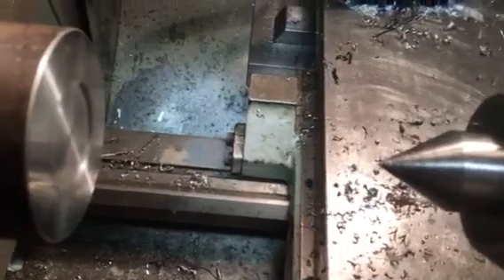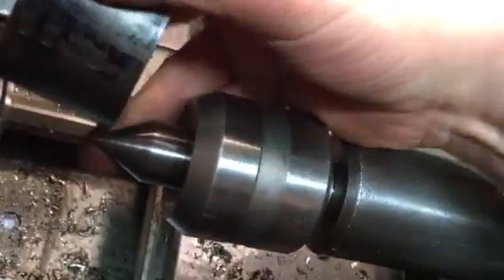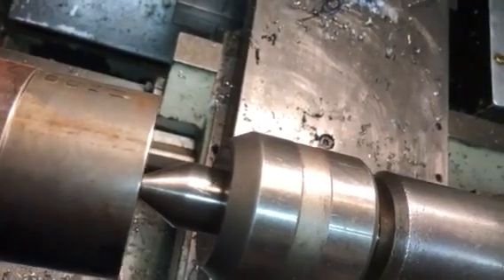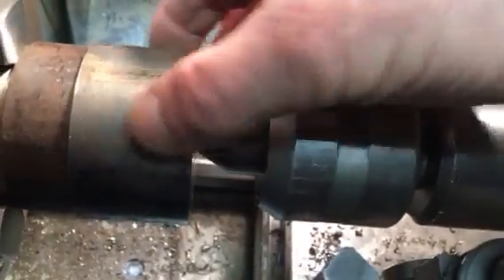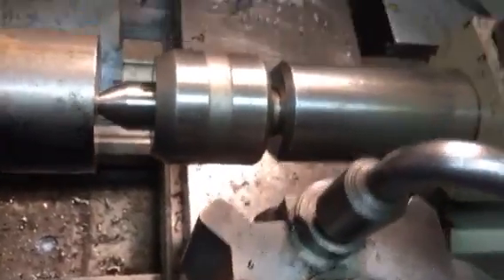OK, so I'll bring the tailstock along. Lock that up. Lock that up. I'll bring the tailstock forward — oops, too far. Right, so the nice thing with this is because it's got the centre in there, drilled off the three-jaw chuck, I know it's going to be running reasonably concentric. I'm not too worried about it not running concentric because I'm literally just going to take a minimum skin off the outside diameter.